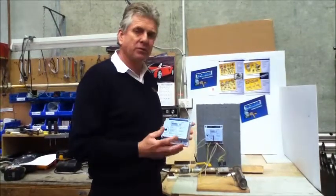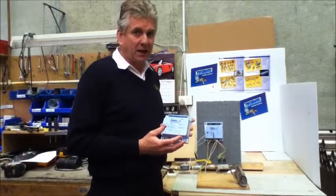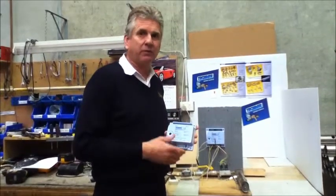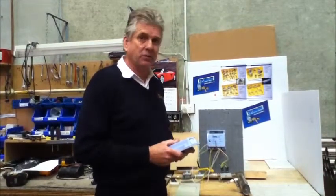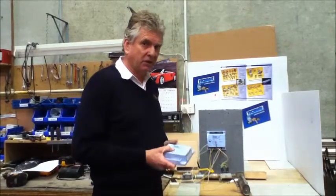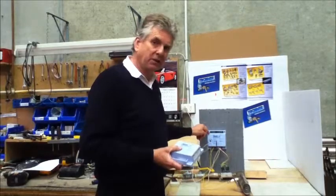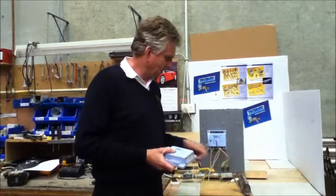The module has a number of variants — there's atmospheric models, models with pilots, different spark times, different numbers of tries for ignition (one try or three tries). You may have local sense or remote sense. Local sense means you're sparking and sensing off a single electrode. This particular one, as I said, is a combustion fan pressure switch model, and we're going to light this burner here with a direct spark setup.